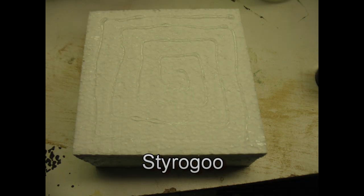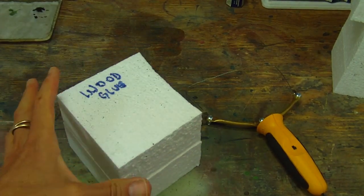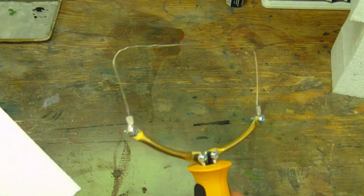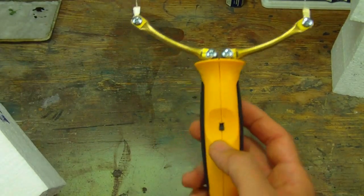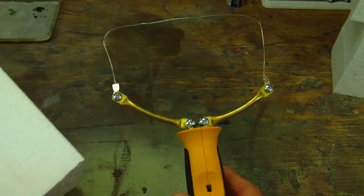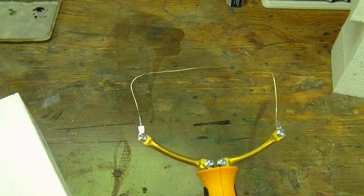So, what we're going to do for the test, I've thought of trying to test this out in three main ways. One will be a cut that transverses the entire seam. So the blade, I'm going to be using the Hotwire Foam Factory's freehand router. It's the only hotwire blade that I have that's big enough to accommodate this foam. And one of the nice things is it has a permanent on-off switch, which I should turn on to let it heat up. And this way, what I'm going to do is hang it and then time how long it takes to pass through the foam before it makes a complete cut, using gravity only to pull the hot wire blade through it. This way, I can eliminate me pulling through the blade at a differential force and hopefully can get something that's relatively easy to compare.